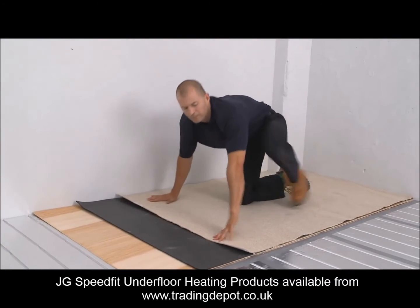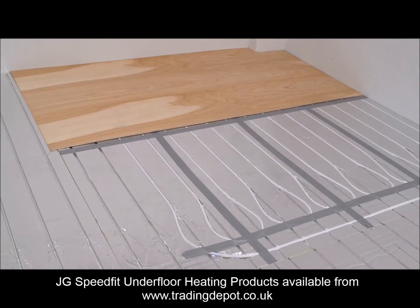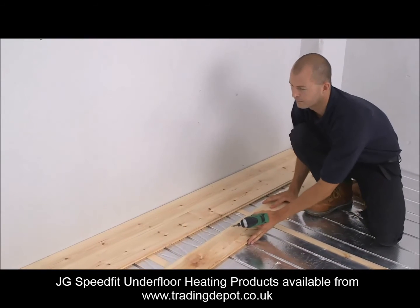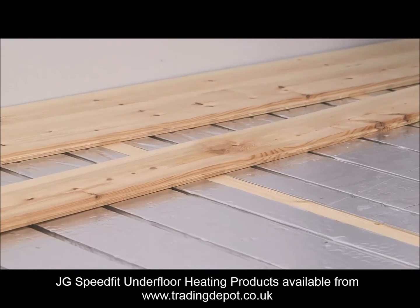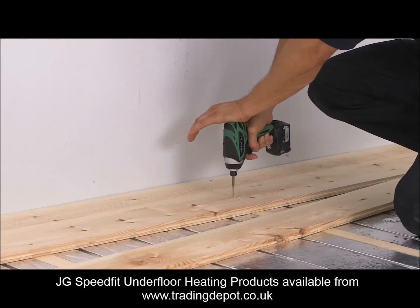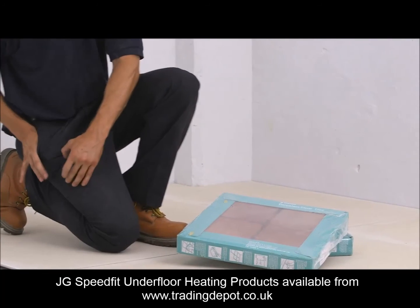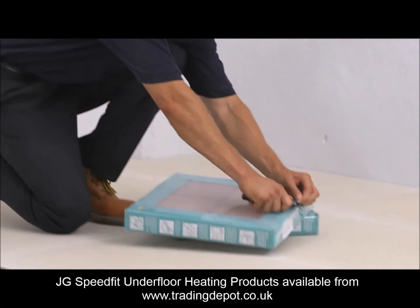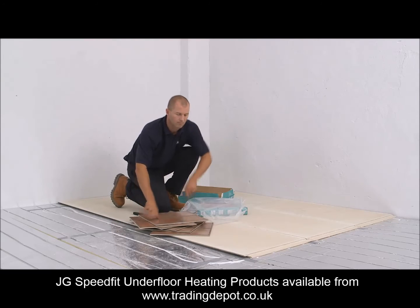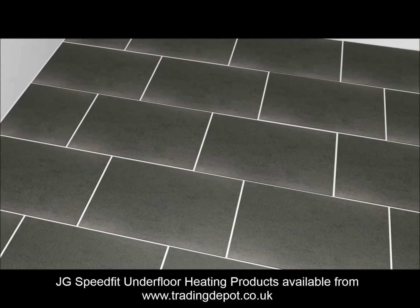You are now ready to install the floor covering. If installing carpet, a plywood sheet should be fitted as a backing — this should be at least 6mm thick depending on the intended use and load. If a floor covering such as tongue and groove boards that needs to be secured is placed on the JG Overfit, it's possible to place 25mm battens between the JG Overfit boards at the installation stage. This will allow the flooring to be fixed with nails or screwed fasteners. When intending to tile over the JG Overfit panels, it's important to use a heavy backer board. Care should be taken to ensure the board joints are secure in order to avoid movement that could cause cracking of the tiles. Heated floors will have a degree of expansion movement, so follow the recommendations of the tile supplier.